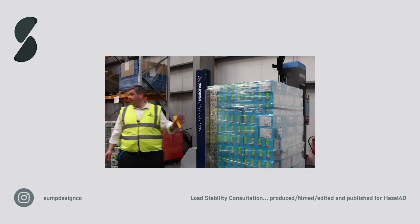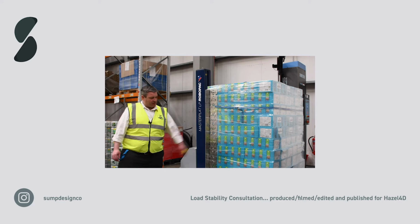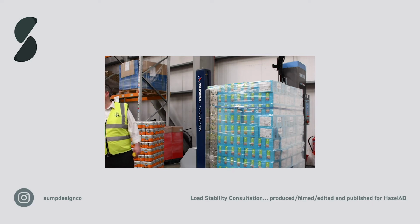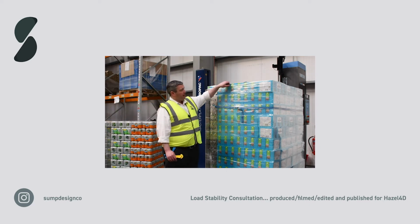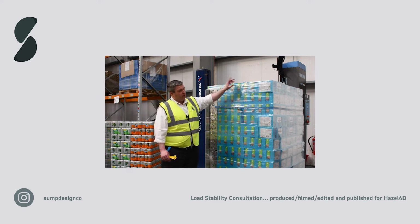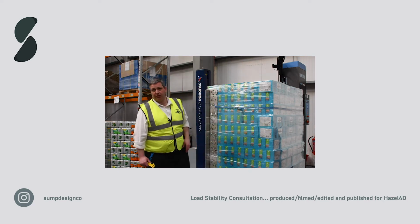So this is wrapping in the Extremis 15 film, 12 revolutions, same as what we had before. And if you notice straight away, you see the clarity of the film. You haven't got any of the shimmery slip bands on it because it's applying the film very nicely. We've got a constant pressure throughout, and we can increase the tension, I believe, but we don't want to go too far because we don't want to damage the corners. We don't want to crush the corners.